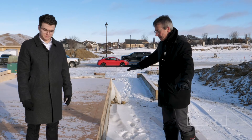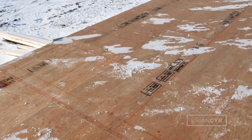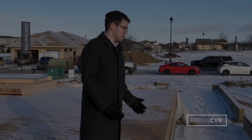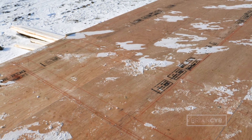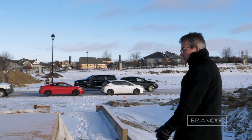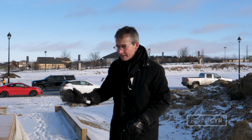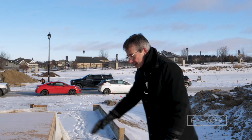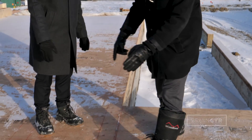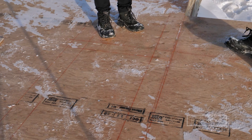So Jeff, we've come up to the capped main floor system and we have a series of red lines going on with chalk. Tell us what's happening. So what the builder's done is they've come up here and lined up these nice long red chalk lines to lay out the exterior and interior walls. The reason they've done it now at this stage is because this is all nice and cleared out, so it's really easy to line up these perfect long red lines. When the framers come up here to snap lines, they've got these big long chalk strings. With no piles of lumber on the floor system, it's very easy to lay them out nice and straight and even — you get a perfect job. Then when the lifts of lumber are delivered, they can start building the walls and standing them up. You'll see the exterior line and then your interior walls coming this way, with an intersection point. This is obviously some form of a closet — 24 inches, which is about right. And that's exactly how the starting of framing begins: snapping chalk lines.